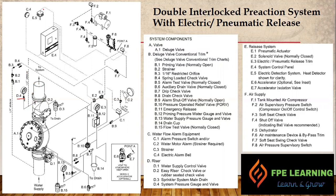The detector E5 detects fire and sends a signal to the releasing control panel. The releasing control panel then sends a signal to solenoid valve E2 to open — it says there is a fire, open. The solenoid valve opens and water will pass from this line, but it will stop at the pneumatic actuator E1, because this pneumatic actuator is pressurized by compressed air. That compressed air will only reduce if a sprinkler fuses. If the sprinkler fuses and the air pressure drops, the water pressure will force the actuator to open, allowing water to flow through.